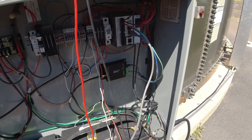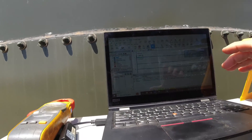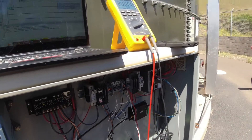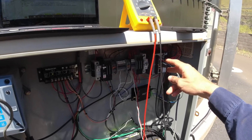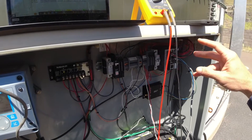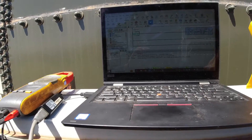I've got my laptop out and we're connected. I want to see data — we have WX0 and WX1. WX1 I believe is tank level, so we'll go down here into element WX1. There's our raw value. The transducer takes the water level in the real world and converts it to a 4 to 20 milliamp signal. That signal is brought into this PLC and it measures the current in milliamps, then takes that and turns it into a raw value from 6,000 to around 32,000 — and that raw value is what's transmitted between sites as the level. I'm still hooked up and generating.